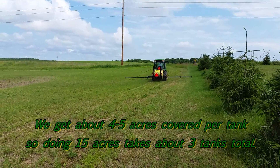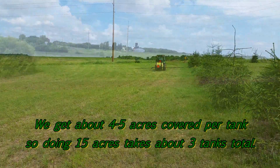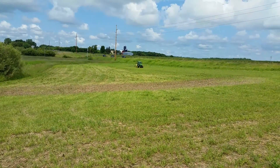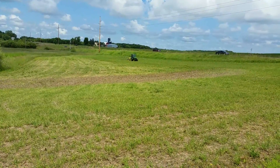In the past I've done this with a 55-gallon boomless sprayer. I found it hard to control drift when it was windy, and it was also a little difficult when you had bumps and ruts in the field. I like the boom sprayer better — I can get closer to the grass and be more exact with my placement.